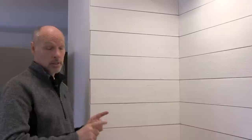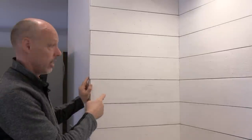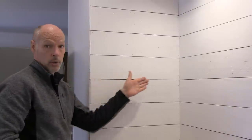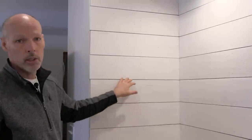This is the half-inch plywood. There's a stud here and a stud here, so when you put this on there's nothing in the middle. If you're using the half-inch you can get some bowing — instead of going straight across, the wood can bow outward. There's nothing in the middle to fix that to. I could have overcome it with glue or a bigger gauge nail, but overall I'm happy with it since it's somewhat random. I just want you to be aware of that.